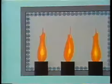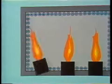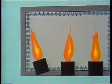Severe bending is a serious problem because it'll restrict water flow, which leads to tube overheating and failure. Wearing away of the tube can result in tube failure as well. Be sure to check for all these conditions when you inspect the clinker impact area at the bottom of the boiler. Flame and fuel impingement occur near the burners. Impingement is the throwing of flame and fuel against the water wall rather than into the center of the furnace.